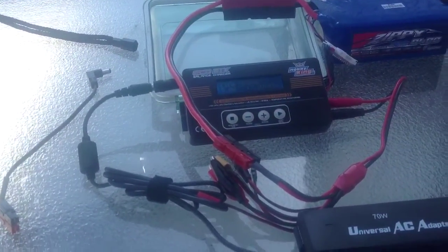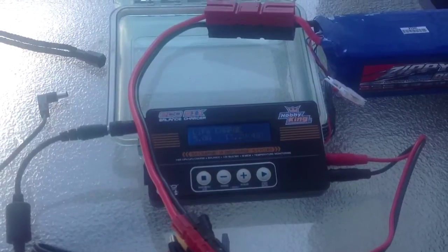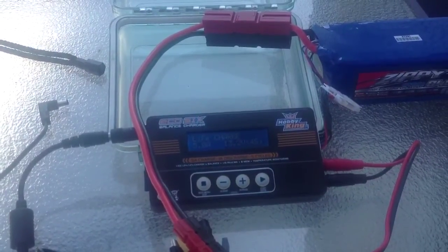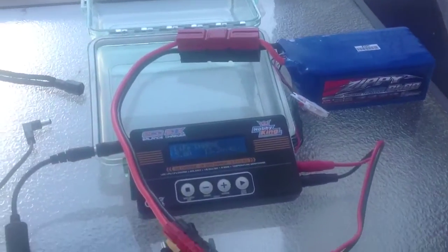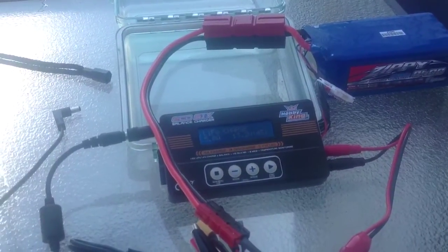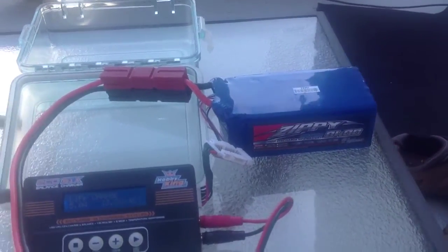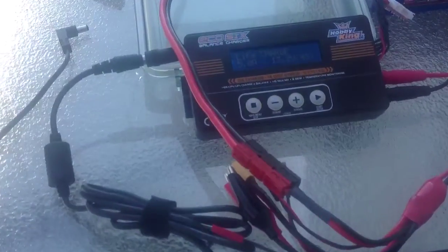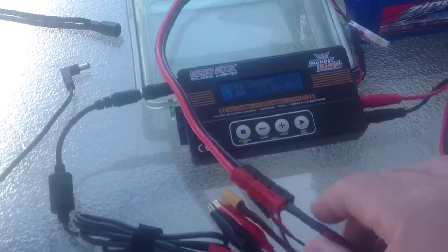What I did was attach that and connect it to this right here, which is my Hobby King LiPo/LiFe battery charger. You can set it to charge either LiPos or LiFe. As you can see, I've got it set to charge my LiFe battery at 13.2 volts, 5 amps. It runs into a little circuit board there which plugs into the balance charger for the battery, so it safely charges it. I had to put Anderson PowerPole connectors on because it comes with many different kinds of connectors, so I just cut off the ones I don't use and attached Anderson PowerPoles.